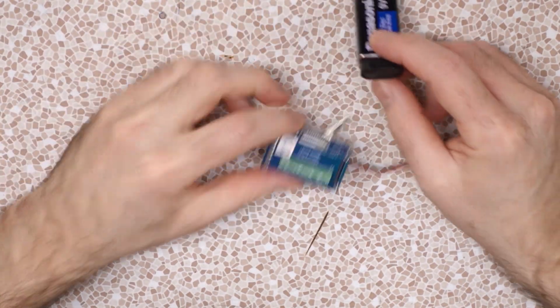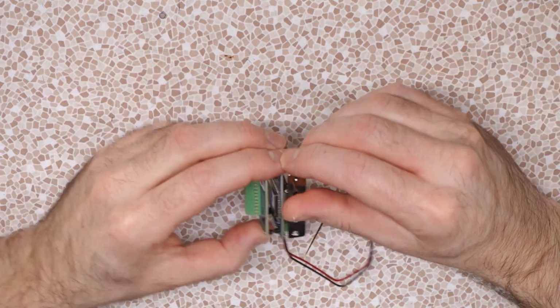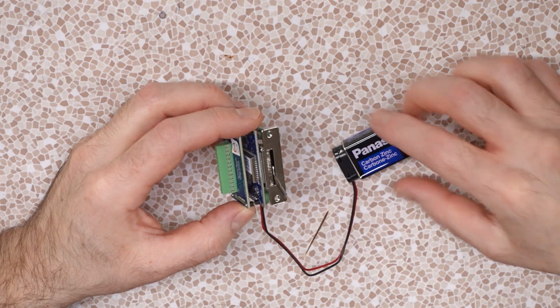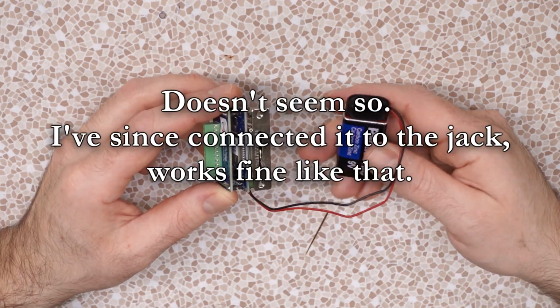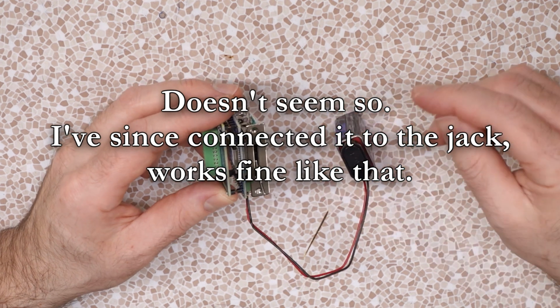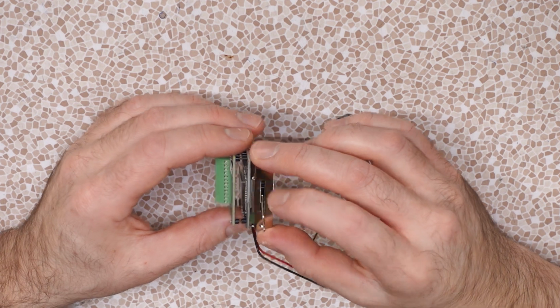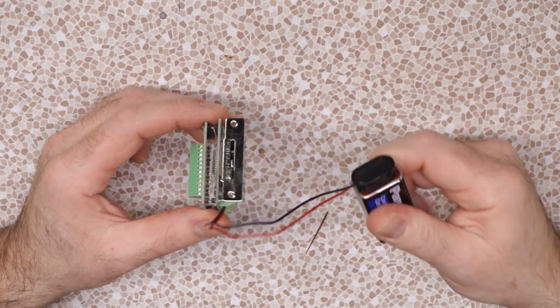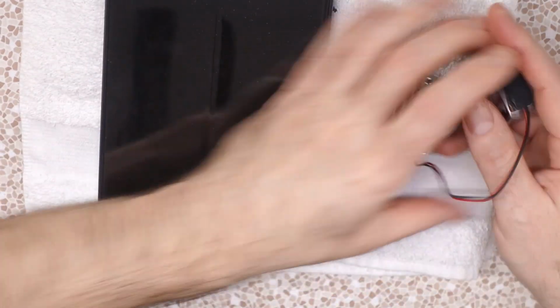And one thing you notice with this guy is it's not designed to be wired to the input jack to turn it on and off, like say an EMG or whatever. I think one of the reasons why they do that, perhaps this thing has volatile memory, and if you disconnect the battery, it's going to forget the settings. But some of these microcontroller devices have such low standby power that even without turning them off, a battery is going to last forever. All right, so that said, let's see if we can't intimidate it.